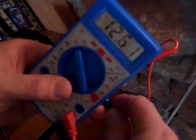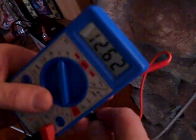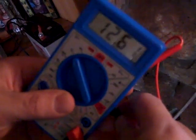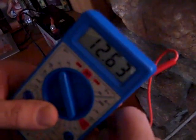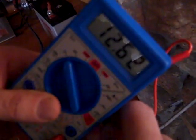When I plug it into the battery, I won't get quite that high a voltage because it's actually charging the battery — so I've got 12.62 volts, started at 12.5. The voltage is more than high enough to charge the battery. On a 12-volt battery, 12.8 volts is full. We're putting in 13.9–14 volts. So it's a 30-watt generator: 30 divided by 14 gives you about 2.2 amps out of the stovetop generator. This thing has a USB port as well, so you can charge your cell phone and your battery too.